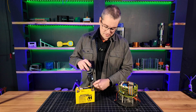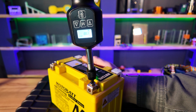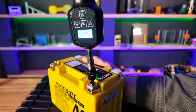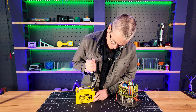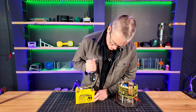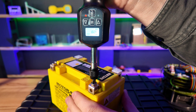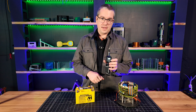I'm going to put this in my screw, and as I'm increasing the torque — the red means that I went a little bit over. I'll try to go a little bit slower this time. Okay, green means I'm there. Red means I went over. And that says my peak was 13.5 inch pounds.